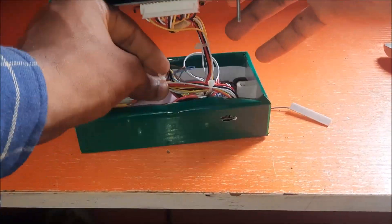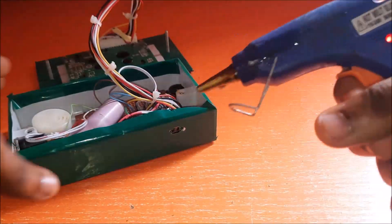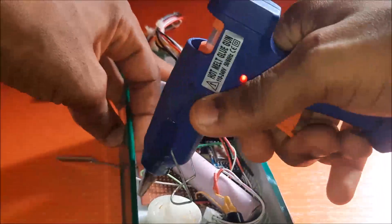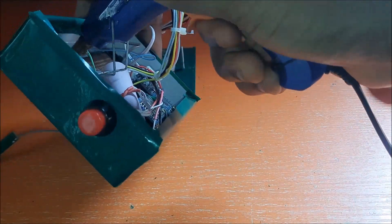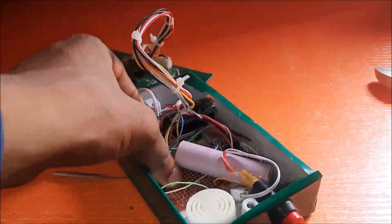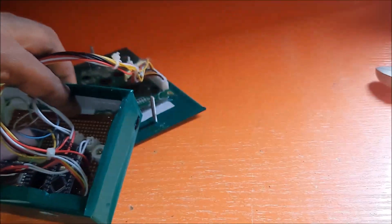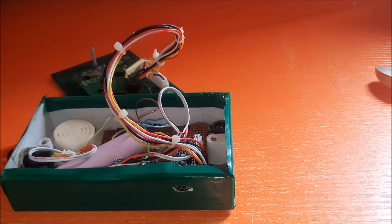Now that it is wired, we used cable ties to do some cable management. Inside the enclosure for the hardware components of the IoT-based health monitoring system, we connected the 20 by 4 LCD module using its 16-pin wire. The buzzer acts to notify the user of extreme levels in the body vital readings. The 3.7 volt lithium-ion battery was used as a backup power source when the system is not plugged into an external power source. The battery is also rechargeable and can be reused.